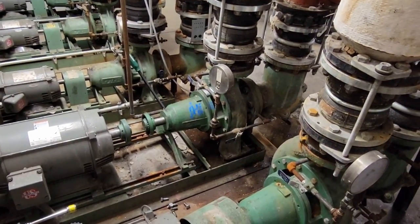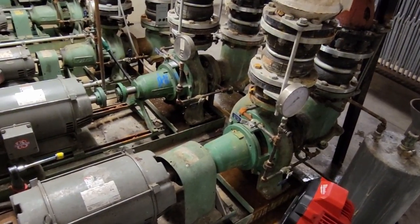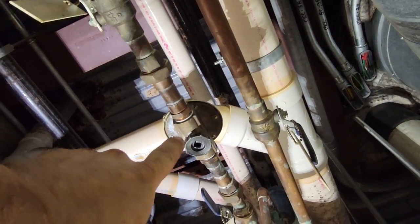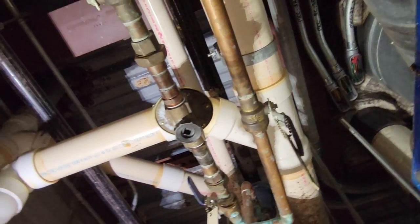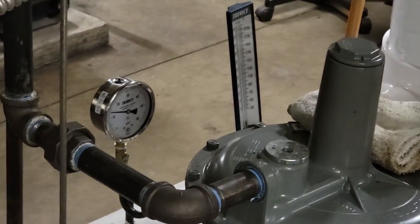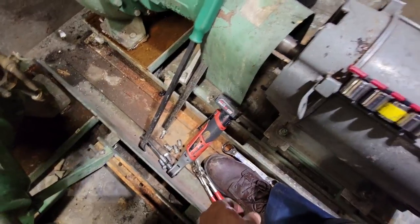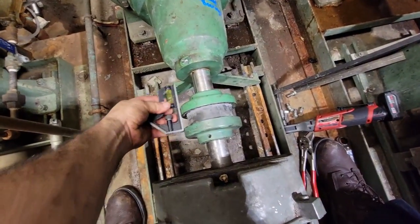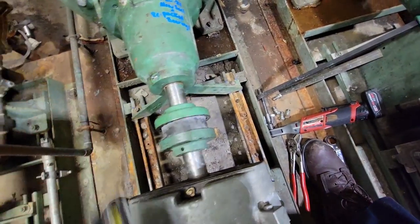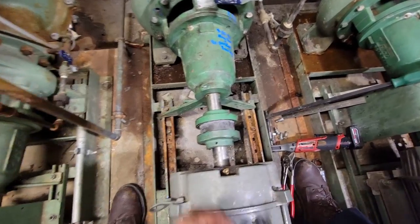We're gonna have to order seals with this — I condemned this nearly six months ago, and with the air conditioning season hitting we haven't had time. The boiler is used for quite a few things here and does have to run year-round. It does have the regular auto fill, which half the time doesn't fill up, plus a bypass fast fill. The newest boiler's got new gauges showing about 15 psi. The poor man's way of getting us back is using your markings along with your crowbar, straight edge, and just lining it up. There are companies that use lasers, but this flex coupling can absorb a little bit.